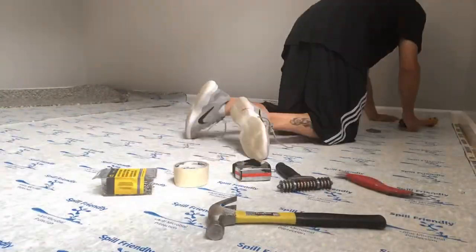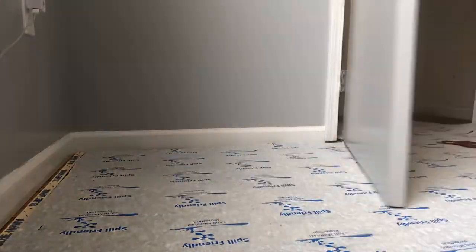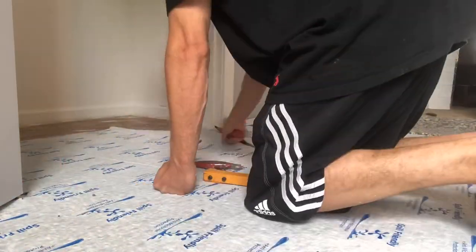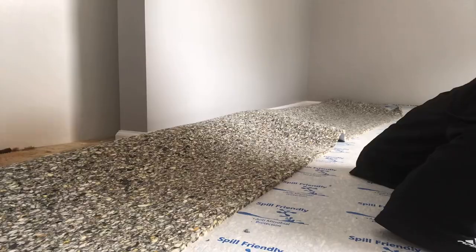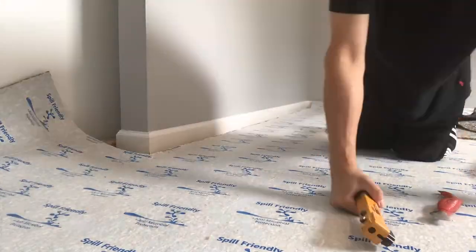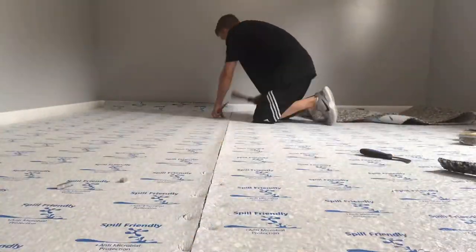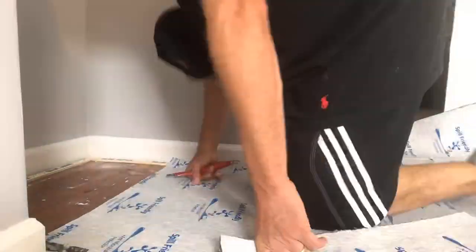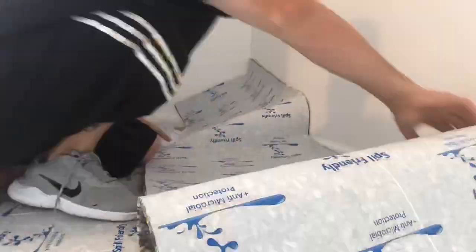And if you get a gap, fill the gap in. Nobody's ever going to see or know, so you can slap and pop and life is good. If it's a wood subfloor, you can swing that stapler all kinds of wild all around the room, securing it to the floor. And then once it's all trimmed in, trace your blade to the tack strip, leaving maybe a hairline gap so when you stretch it, there's a little bit of wiggle room and the pad doesn't go on top of the tack strip. Just that little teeny tiny gap from the pad to the tack strip will be perfect.